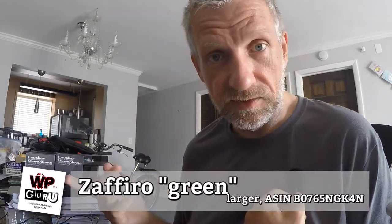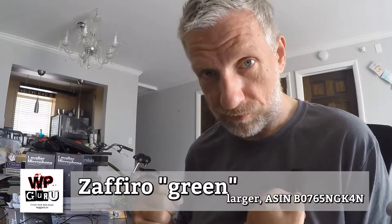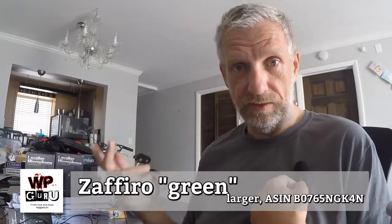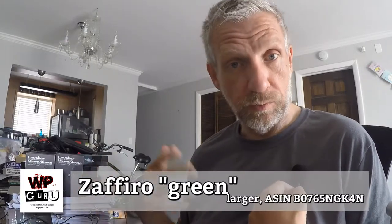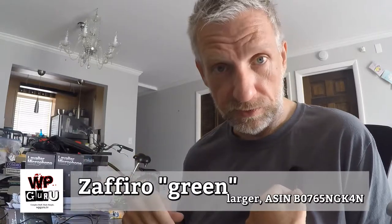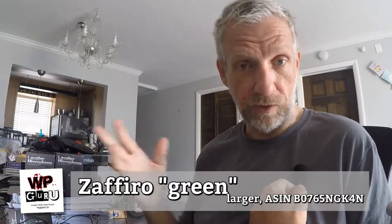And again, it's important to understand that on mobile devices, we usually don't have a way to control the input volume of the microphone. So you're running less risk of this distorting in mobile field recording on iOS or Android devices. By the way, this works equally well on Android as well as iOS devices, and of course on computers. Usually Macs and most PCs are TRRS capable to record that jack without an adapter.